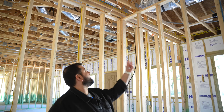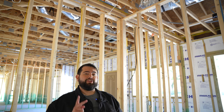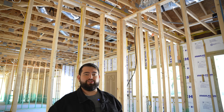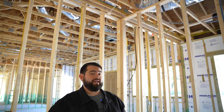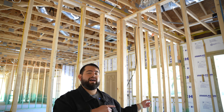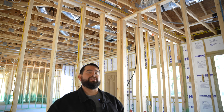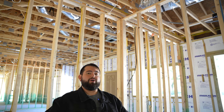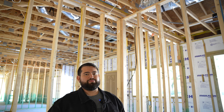In this back corner of the living room you'll see a white cable coming down — that's going to be one of the Ubiquiti wireless access points. I'm actually using two here. I used Ubiquiti's home design guide — it's free and I'll link it — where you upload your floor plan, specify wall materials, and it shows projected coverage across the house. The access points are Power over Ethernet so I didn't need separate electrical runs. My office is on the other side of this wall, so I'll have good Wi-Fi coverage there too, alongside HomePods acting as Thread border routers for smart home devices like light switches.